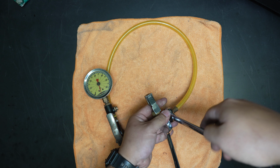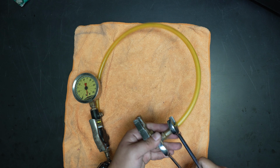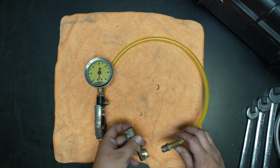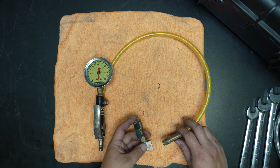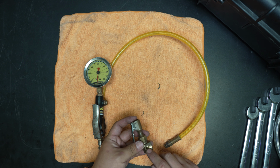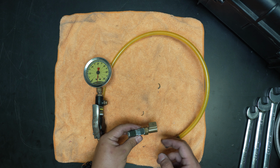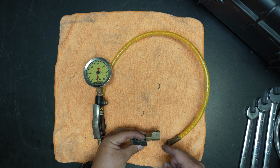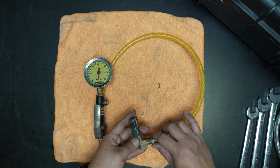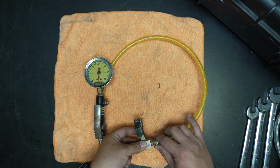First, I'm going to take this off our hose with a simple wrench. So this is a 9/16 and an 11/16. All right, well, that was more difficult than I anticipated with 15-year-old Loctite. If that happens to you, what I would recommend is getting a propane torch and heating up and melting that Loctite, and that'll help get these two parts disconnected from each other.